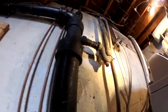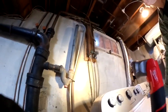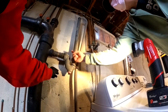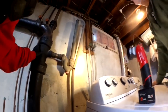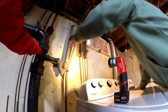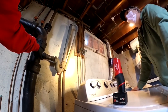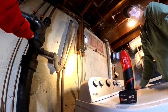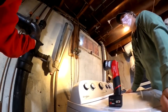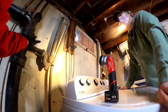So this is actually proper. You can always get it changed and put PVC in, but that's a whole other can of worms. So you took this off and tried to get a snake up in here, and I couldn't really get anything up there - I just couldn't make that curve. The problem is usually right here. Because the cast iron buildup on the inside flakes and rusts. Right in here is usually where you're going to have your issue - you get pipe scale and that buildup, and then whatever's coming through gets hung up - lint, soap scum, all of that builds up right there.